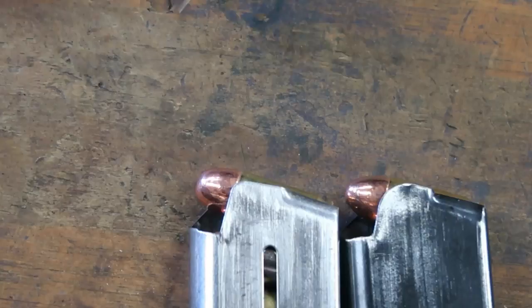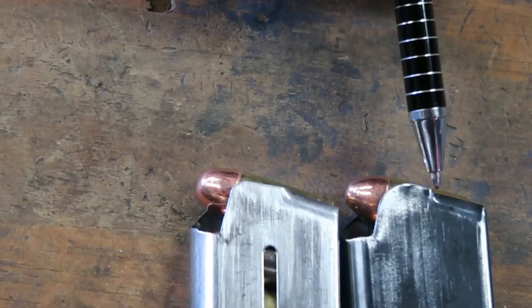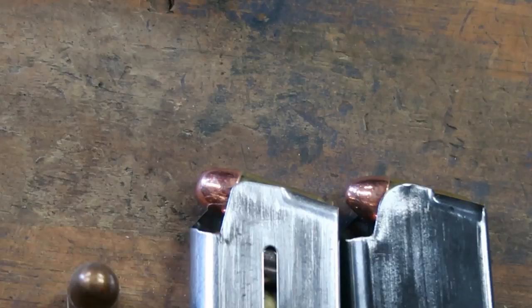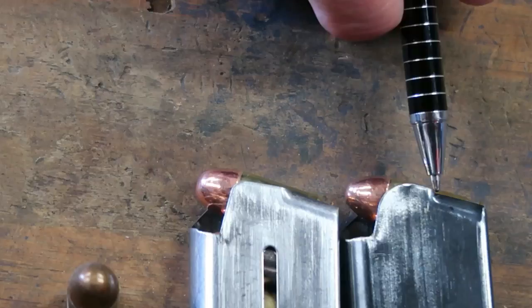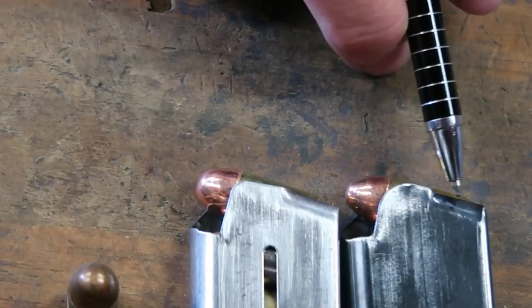Your feed lips — that's critical. If you buy a new 1911, take one of your magazines with you and buy the magazine that it is designed for. Leave the ones for the wad cutters alone — get the standard ones, unless it's the three-inch barrel version. This is an FYI video, just like the previous one I put up on skint bullets. The length of the feed lip on the new magazine should equal the length of the feed lip on the magazine that came with the firearm.